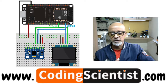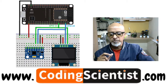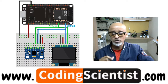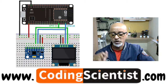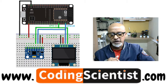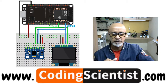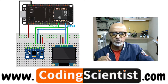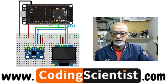Now let's look at the circuit. Hook up your OLED and the MPU 6050. I showed you how to download the OLED library in a previous lesson — you'll need that. Connect SDA of MPU 6050 to SDA of OLED, SCL to SCL. Both share GPIO 21 and GPIO 22 of the ESP32, with a common ground and common 3.3V VCC.